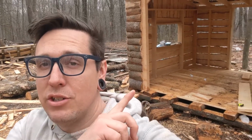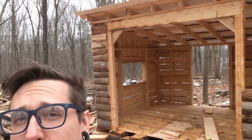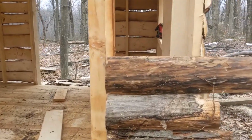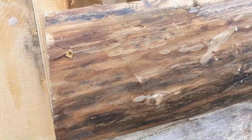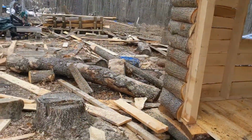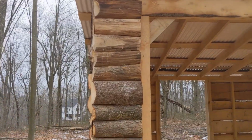But I would really like, in future iterations, to have 1-inch slabs, basically what I used for the strapping up there, for the siding, over the top cuts. Let me flip the camera around. The top cuts are great because it's technically a waste product from the mill, so I can use this, and it actually looks pretty cool. It gives it sort of a log cabin look.